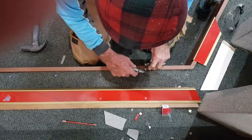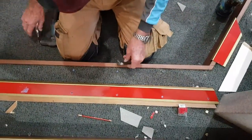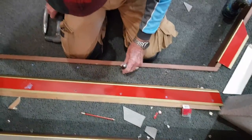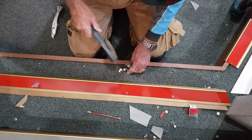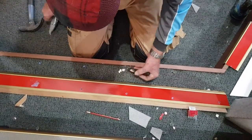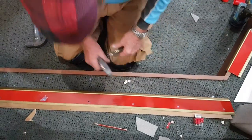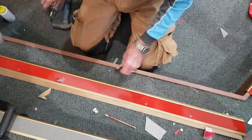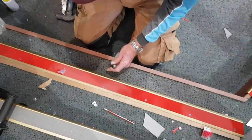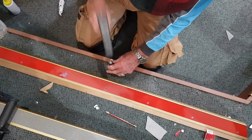I've just got to make sure that it has gone through to the concrete. This is an interesting installation because the riser of the step is made out of jarrah, and we've got Broadloom carpet on the tread. And right on the very edge of the tread, we've got smooth edge, because that's what's holding the Broadloom carpet in place, and it has made our job very, very tricky. At times, we've discovered that we've actually hit the smooth edge.